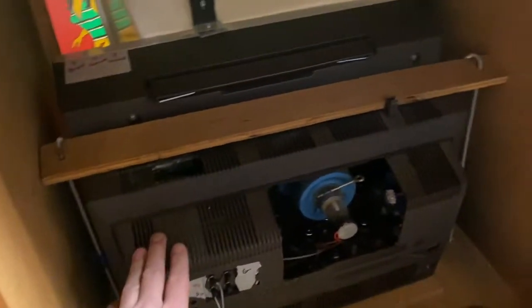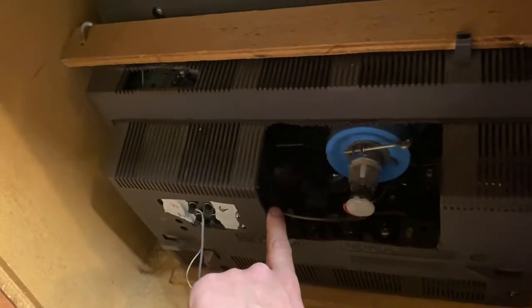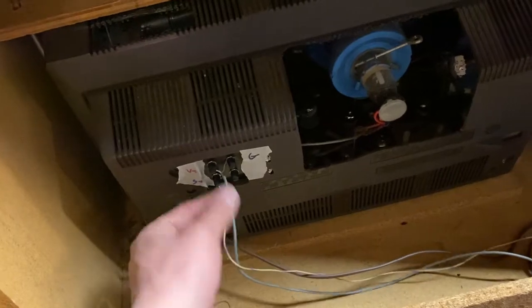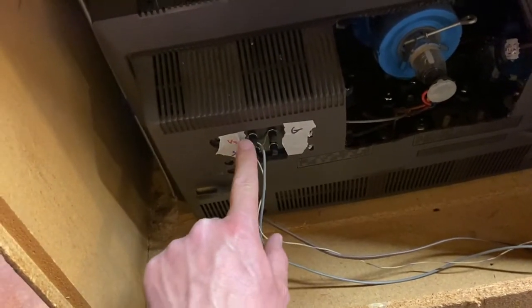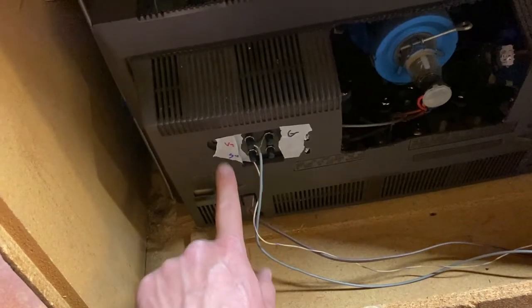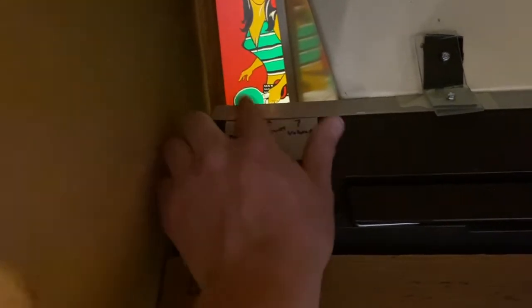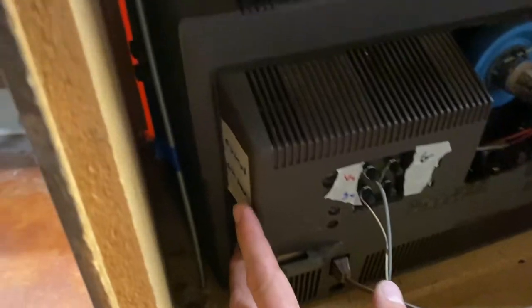This is a black and white television that's been modified internally. Parts have been cut, things on the inside have been removed, and it's been hardwired to be more of a component video setup. We've got our ground for sound and our component, our video signal and our sound. I decided to label things. And even on the top — because it's a television — the brightness, contrast, and volume are up on top. On the left side you can barely see it, but that's where your H hold and vertical hold are.